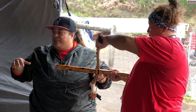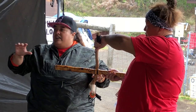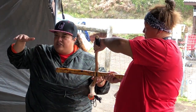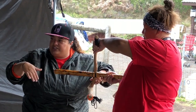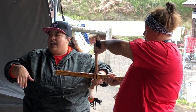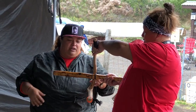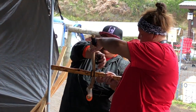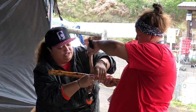When you do dry stack, when you're making pohaku, you find the alo, you find, if it's not flat, a little bit of slant, it's touching three ways, so that all that inertia is going inward to fortifying the rock wall, and it's not gonna just, you know, fall off. Okay, so again, inside, inside, inside, yeah? And this is what you continue to do.